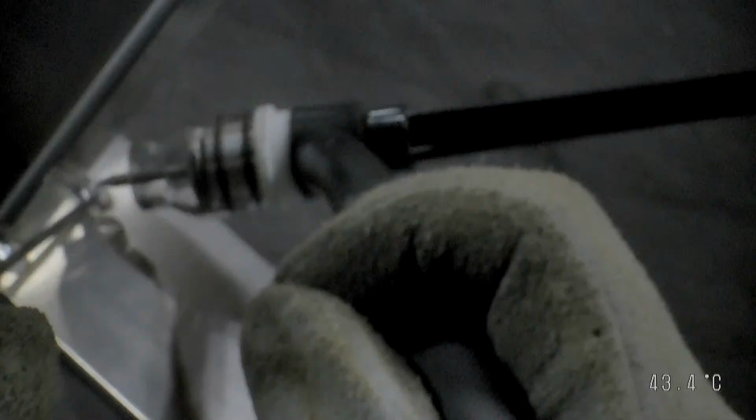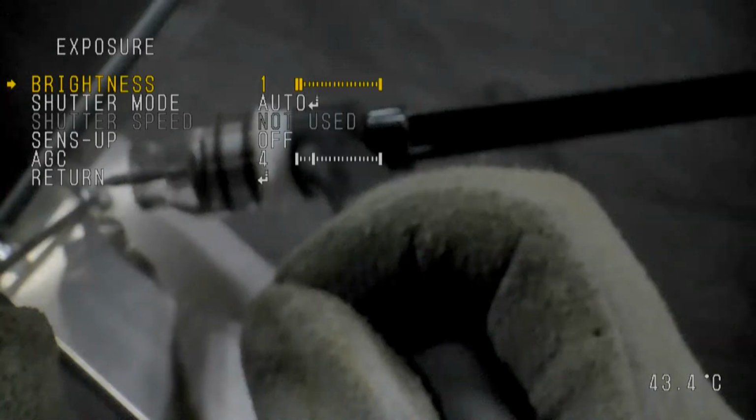So here we go. Again, I'm not starting right here on the very front edge of the toe. I'm going to start back like on that previous run. Here we go, melt it back in, move up to my thicker piece. Nice termination.